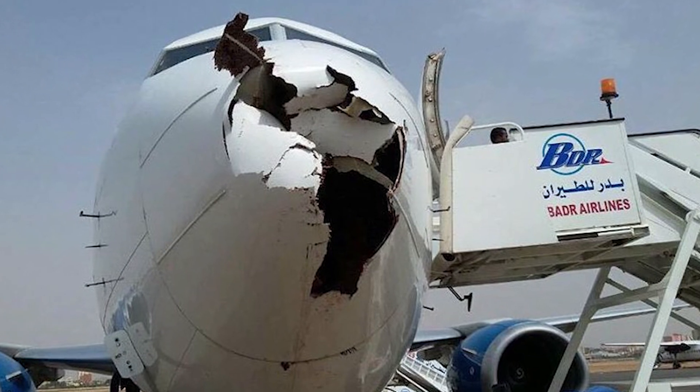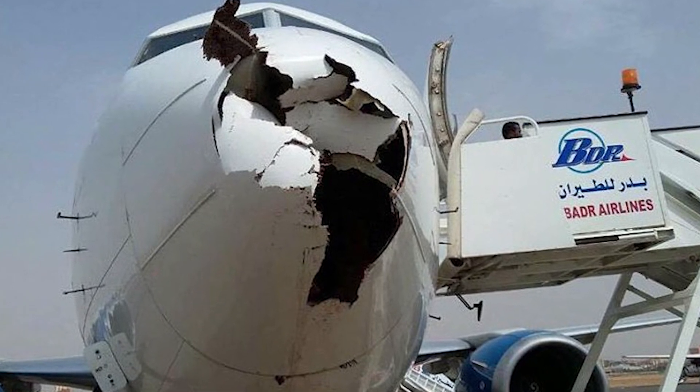The third thing we need to think about — and this tends to be a common problem — is how is this radome going to fail? The most common failure of a radome is not necessarily lightning protection. Bird strikes are a big one; taking a bird is a very common thing, especially on larger aircraft. But the most common problem is water — getting water inside the radome. How can we mitigate that? From a lightning protection standpoint, we should be designing the system to not penetrate through the radome. Or if we do have to penetrate through the radome, we do it in very minimal areas and we seal those areas thoroughly so we don't have water getting into the radome structure.